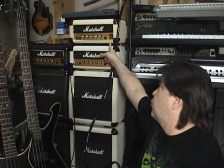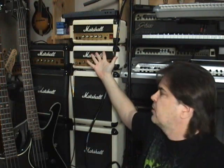Look on the back of any amplifier you have too. This is for everybody who screws up. This is a 12 watt, in actuality, this is the Lead 12. It's a 12 watt solid state amp. On the back, it'll say something like 85 watts, and people will advertise that on eBay as an 85 watt Marshall head. No, it's a 12 watt solid state head, but it draws 85 watts from the wall. So they think it's an 85 watt amp. So people are just that dumb.